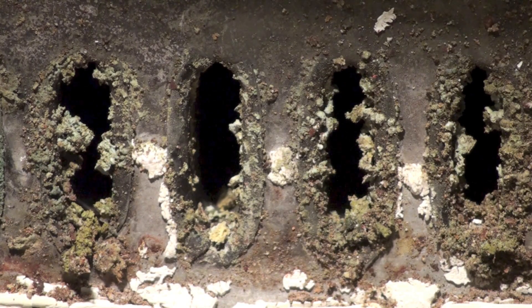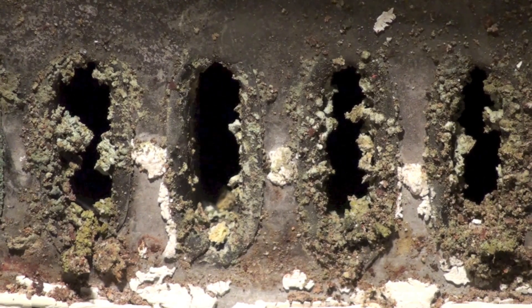You could take a brush and a vacuum cleaner in there and see if you could clear that out. Remember, this is a 25-year-old furnace, so I'm not sure you'd come out too well on it. I went ahead and cleaned this one up with a vacuum cleaner brush just to see what would happen, and it still did the same thing. I put some water into the secondary heat exchanger and the water leaked out — so it's probably rusted through the secondary heat exchanger.